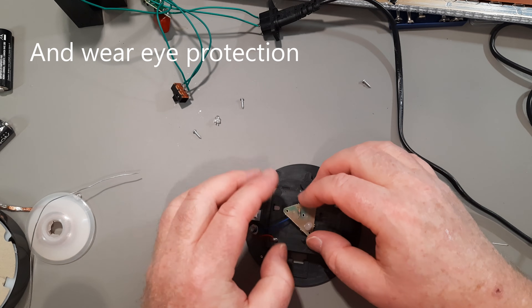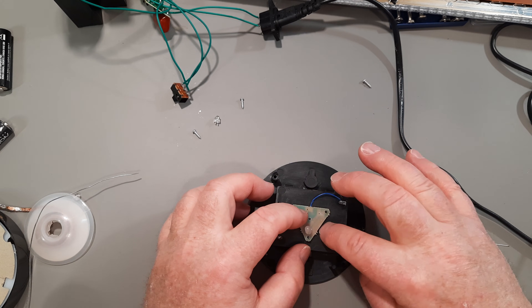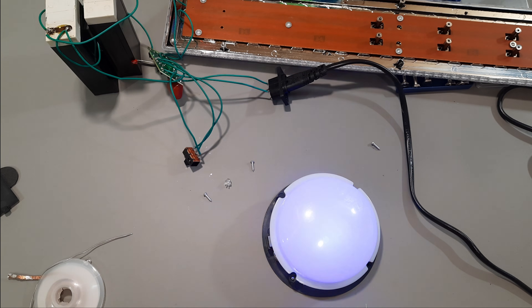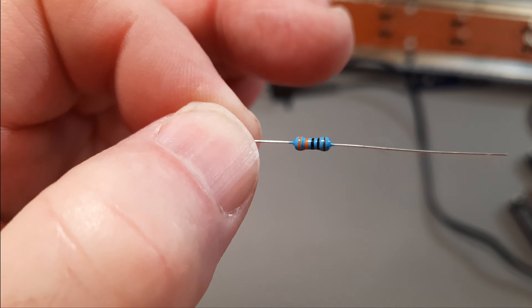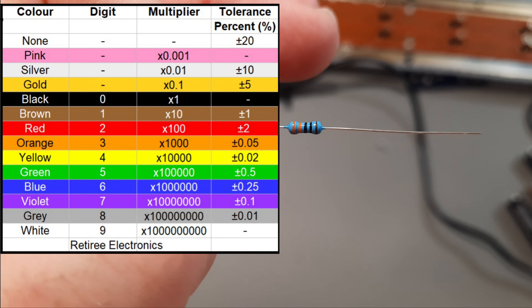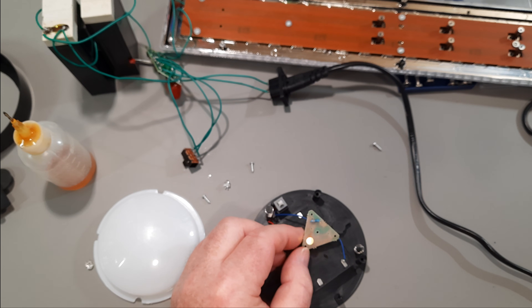Let's see what it looks like. I'll probably put a dab of hot glue there when I'm finished. I inserted the batteries — this is actually going to be too bright. I'm going to want to drop the current draw a tiny bit, so that 20 ohm resistor is going to probably be a tad higher. I'll stick a 330 ohm resistor in — orange, orange, black, black. So there it is with 330 ohms. That's going to drop the current draw by quite a bit. Probably could even go higher, but this is good enough.